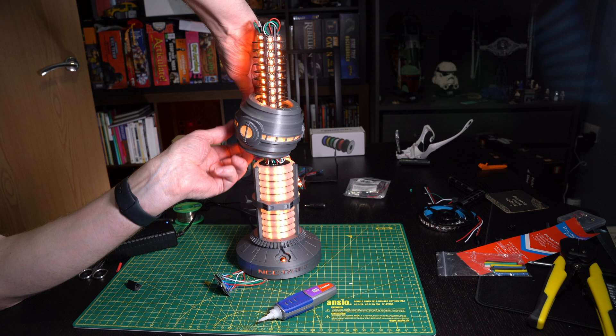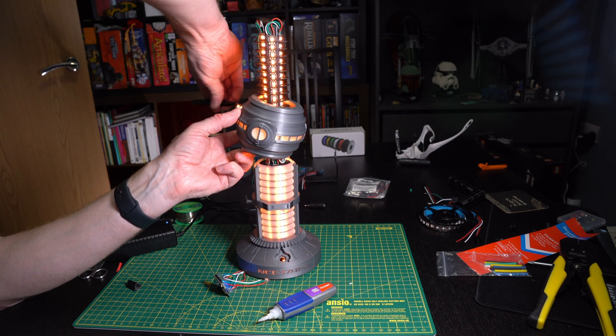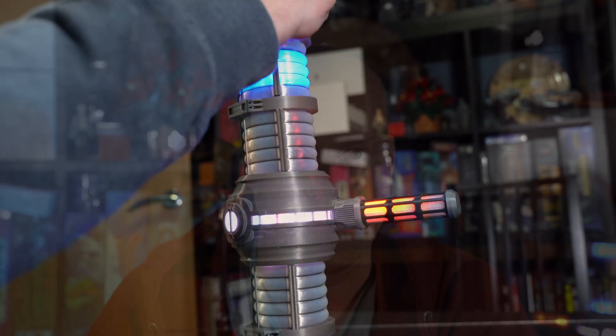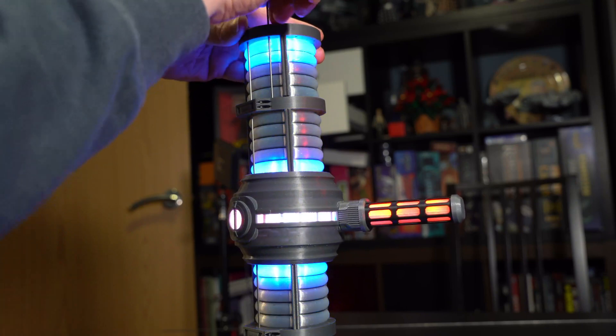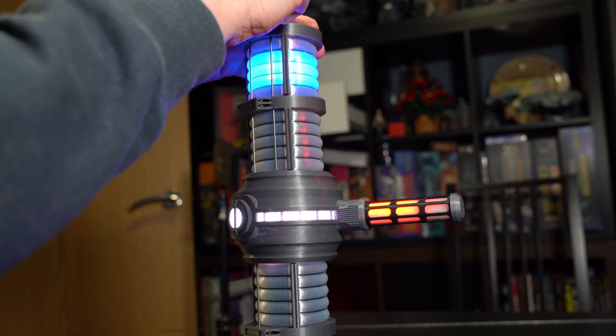When it came to the chamber I found it easiest to get the side parts out using tweezers, just dragging them through the holes and then assembling the sides. After that the upper assembly is pretty much the same as the lower. The final touch is threading the music wire through. Take this slowly especially for the chamber because it can be a bit fiddly so you might have to lift it up and then reinsert. However, if you drilled the holes out previously and test fitted, this should be pretty painless.